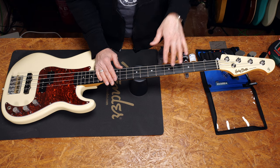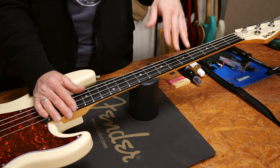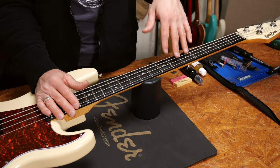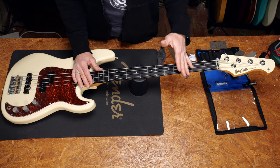Especially unfinished wood needs some attention and protection to avoid serious issues. Why is it so important to oil unfinished fretboards? If you let wood dry out too much, it will become so stiff that the truss rod cannot adjust the neck anymore — and that's a big problem. Unfinished and unoiled fretboards can start to crack, which looks nasty, and it can also lead to frets popping out or becoming loose.